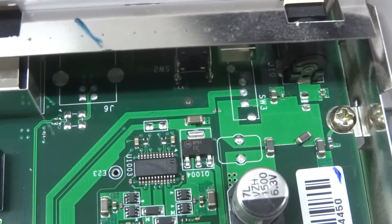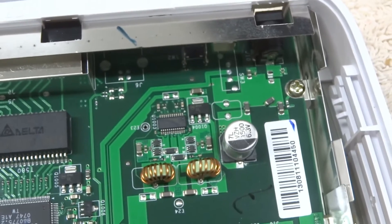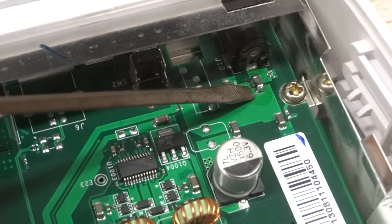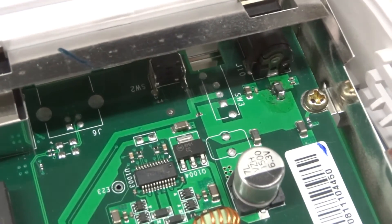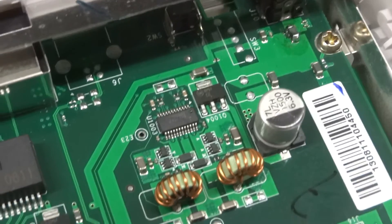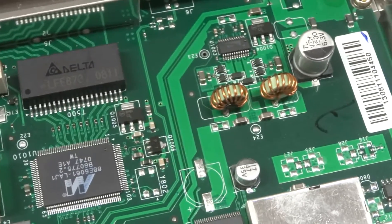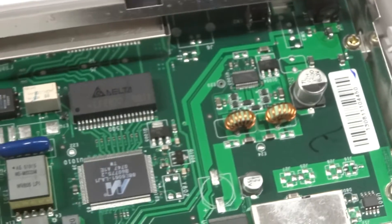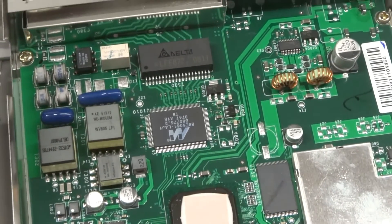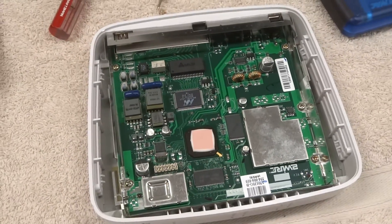It shouldn't be so loose that it comes off just by probing it with a meter, so I'm going to solder that back on and check some other components to see if there are any other loose solder joints. It could be as simple as cracked or loose solder joints. I got that little surface mount resistor soldered back on, and it helped in so much as current was able to flow a little bit further. I was able to get some voltage readings on the various voltage regulators — I was expecting one of them to be wrong, but they all check out. I've probed around for about an hour on different components and checked both sides of the circuit board, but I don't see where the fault is.